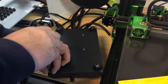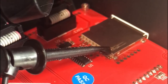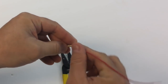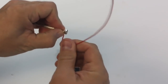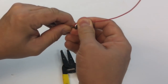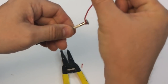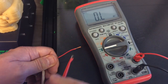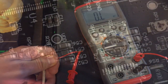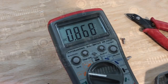So I took apart the electronics box, got out my voltmeter and clipped the negative lead to a good ground point — I found that on the SD card case. For the positive lead I stripped a piece of wire and wrapped it around a metal screwdriver. The metal screwdriver will touch the potentiometer and allow me to read the voltage. This is very low current so I don't have to worry about getting shocked. I clipped that wire to the positive lead of my voltmeter, then touched the screwdriver to the potentiometer at the stepper motor driver and I saw 0.868 volts.